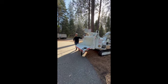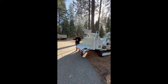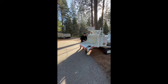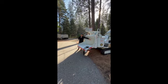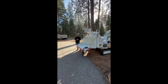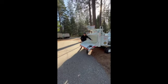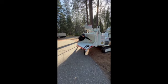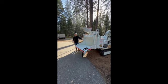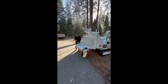With that being said, guys, firewood sized pieces, as you guys know, are not ideal for these machines. You want to leave them in about 3 to 4 foot pieces for multiple reasons. One, for your ease of operation of sending that wood through. Two, you guys could see that dead space we were talking about earlier between the feeding system. A lot of times what happens with firewood sized pieces, you throw it in, it hits that feed wheel, it bounces back to where you're now tempted to reach here and kick that material in. Obviously, you're putting yourself in harm's way doing that. If that happens and that wood is sitting there, let the next guy with his load push that material in with his bite of the material.